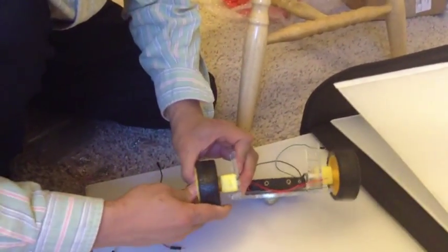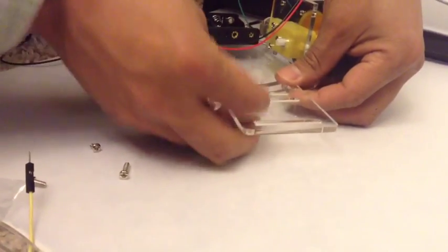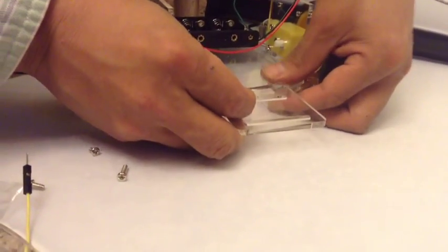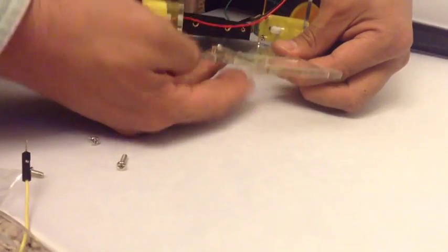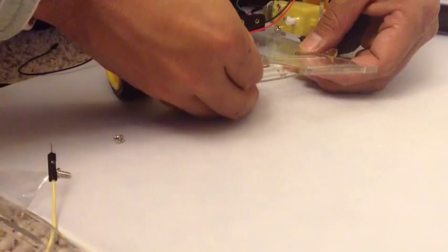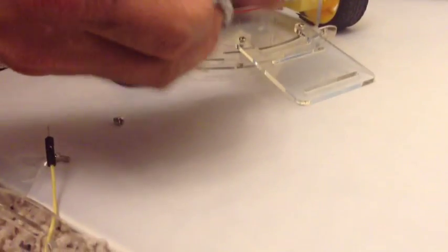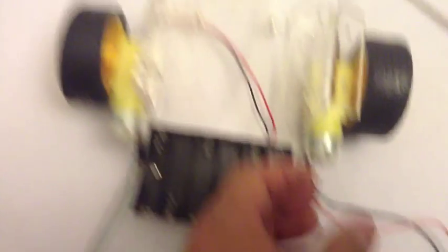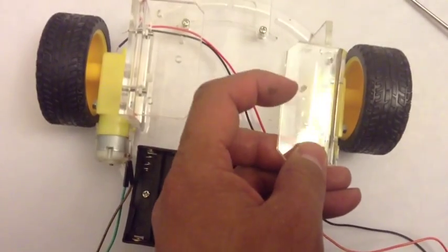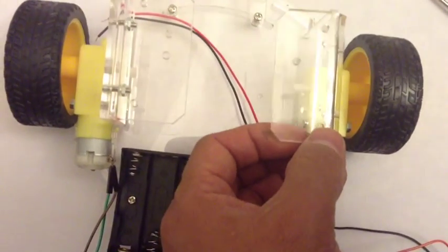And then you should have a car that looks like a platform with a battery box. The platforms are for sensors and the camera that we'll add later on. Still do it with the screws and nuts — use the medium ones, not the small ones. He's just attaching the sensor platform towards the front. We take the right-side fixture, which has one hole in the surface.